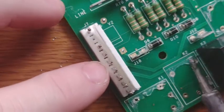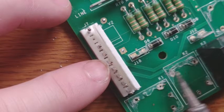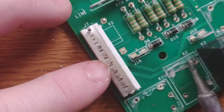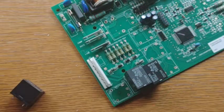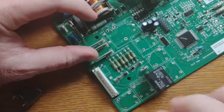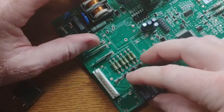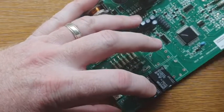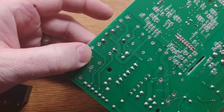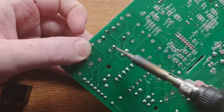If you find that you've got buildup of this conformal coating, a lot of times you can just take your iron and kind of burn it away a little bit, flatten it out. Another thing you may run into is doing things like this will cause those holes to clog up, and that's no problem either. Just set your relay where you need those pins to pass through, flip your board over, and then if you heat up where that pin goes through, it pops right through.